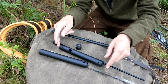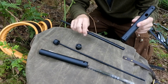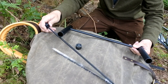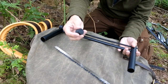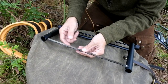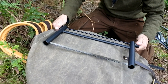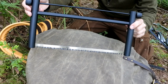When it actually comes to constructing the saw, you've got to make sure on the handle section here that the little slits are at the bottom and just on the inside, because that's how you attach the blade to it. You've got a couple of holes which run at the top end, and we're going to use the bigger holes to put the centre main piece in — again just making sure that slit is at the bottom on the inside. Then I just get the main fastening bar and run that straight through there to hold everything together, then use the other little part which has the thread on it to start tightening it up. I'm not going to tighten it up too tight until the blade is actually in. Once the blade is located, just tighten both ends up nice and evenly, keeping that frame as straight as possible — and it's as simple as that, the little bow saw is ready to go.